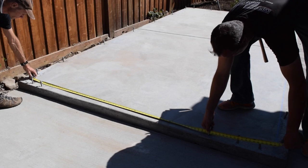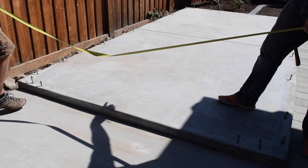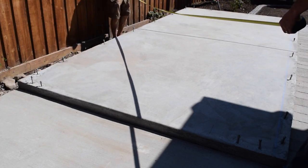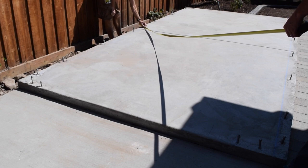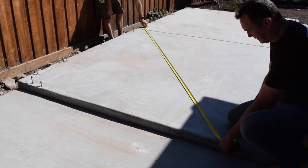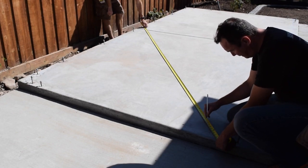An arching line is made by pinching the pencil to the tape measure and dragging it while someone holds the end of the tape measure on the point. Now go to the 8-foot mark on the long wall chalk line and measure 10 feet from that point down to the arching line and put a second arching line across it. This is the point that will create a right triangle.